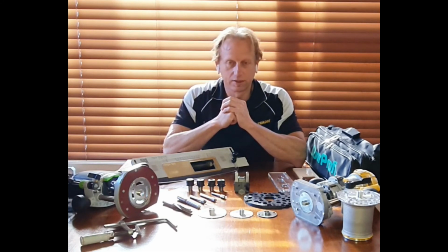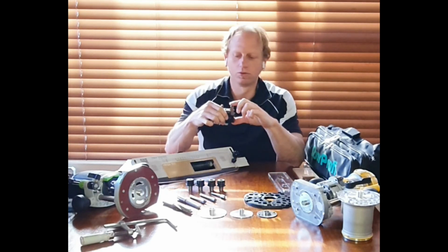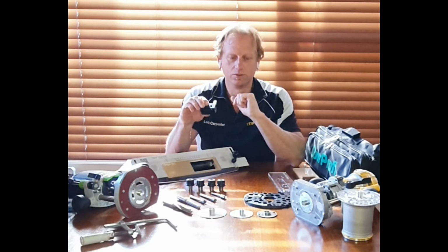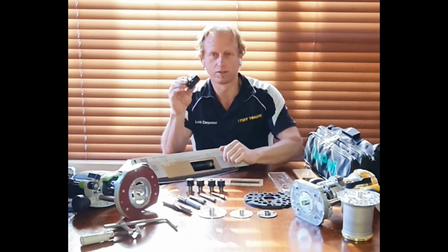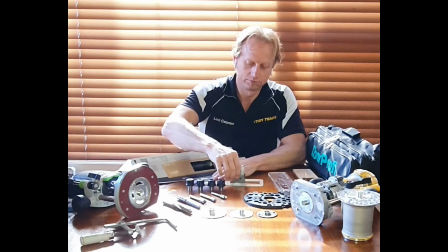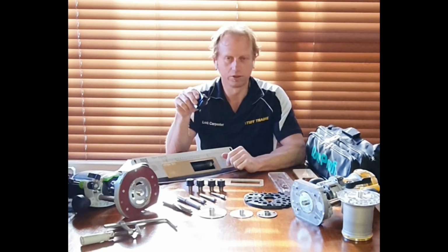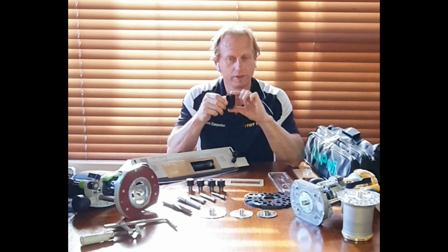We'll be selling accessories for installing doors and hardware. What I'm excited about is a double corner chisel, which has two advantages. One, obviously the speed. You just slide up and down, tap, tap. You can also do lock face plates. This will fit inside a 22mm faceplate.